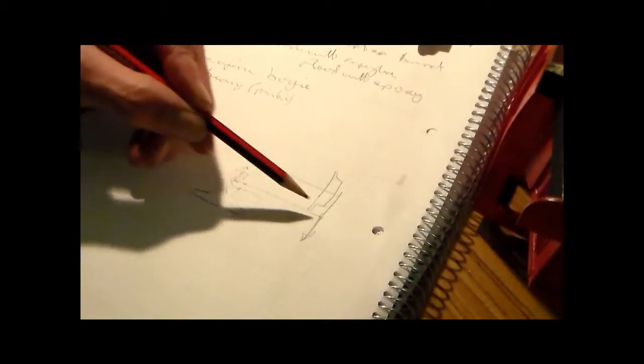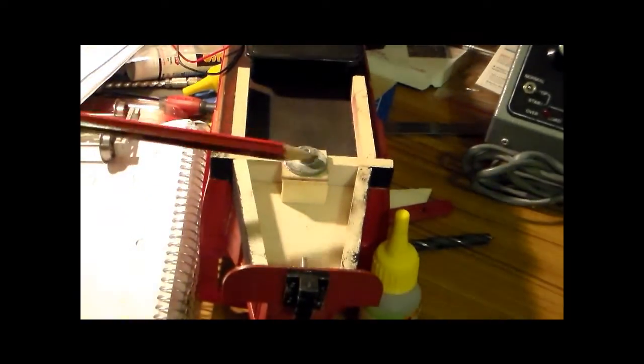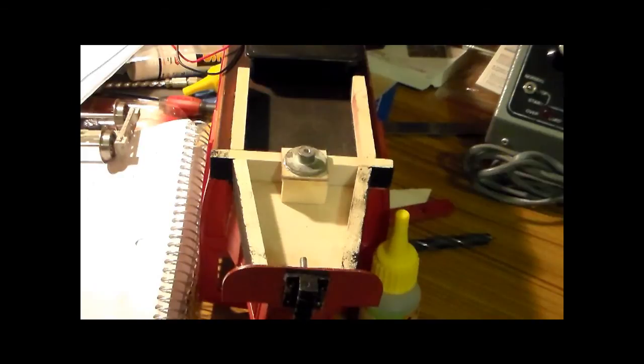See, it runs quite freely when you've made it properly. You've got a fulcrum there with a 20-to-1, 10-to-1 lever mechanical advantage, which is going to apply quite a strong upward force there. It's no wonder it strips it, particularly as the screw supplied to go into there only goes in by about 3 or 4 threads. And this is a cast white metal, which is mainly lead, isn't it? I mean, it's not the most strong. I know you're supposed to glue it in.